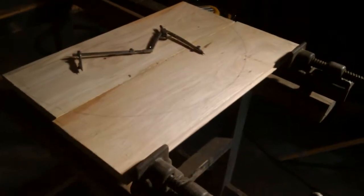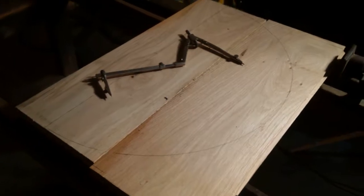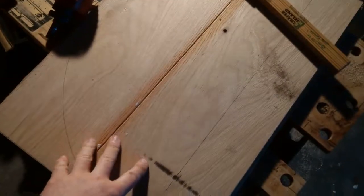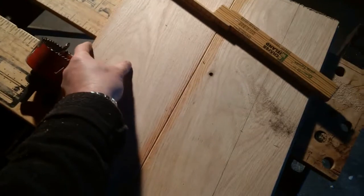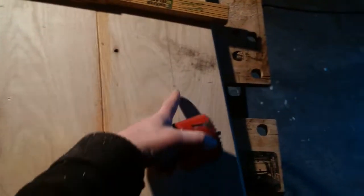Next step: I glued boards together, planed them down, glued them together from one surface, and scribed the semicircle for each half. The bit that comes off here I'll reuse underneath for the supports. The original was kind of like this — the narrowest part was on the inside, and I'm guessing it's so that you would have a very thin kind of bit at the edge that might give way under pressure.